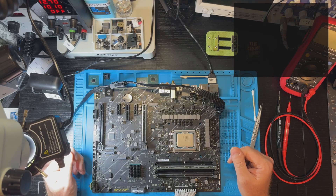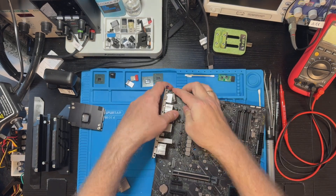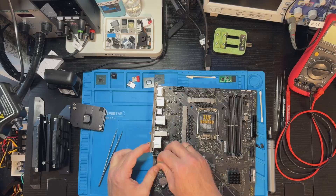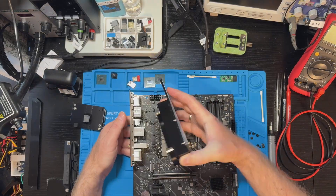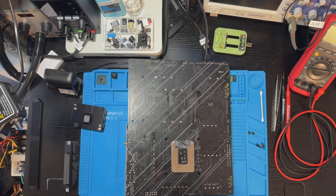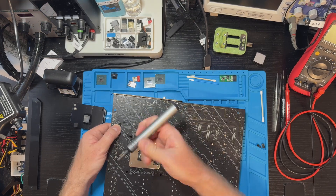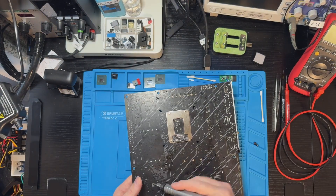Let's assemble it. It's also worth mentioning that even if a motherboard passes stress testing, I always take time to inspect for missing surface-mount capacitors. Those don't usually stop a board from functioning, but they play an important role in stability by filtering the power rails. As a general rule, a missing capacitor is usually not a big problem — it may slightly affect stability, but the board can often function without it. In contrast, a shorted capacitor is a serious issue, as it can bring down the entire power rail. A missing resistor is also critical, since it breaks the circuit and prevents signals or power from reaching where they are needed.